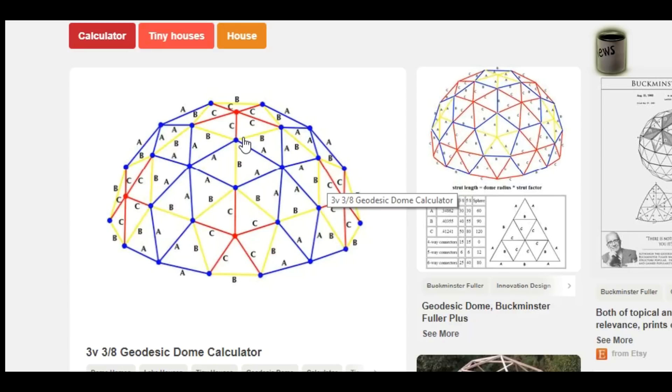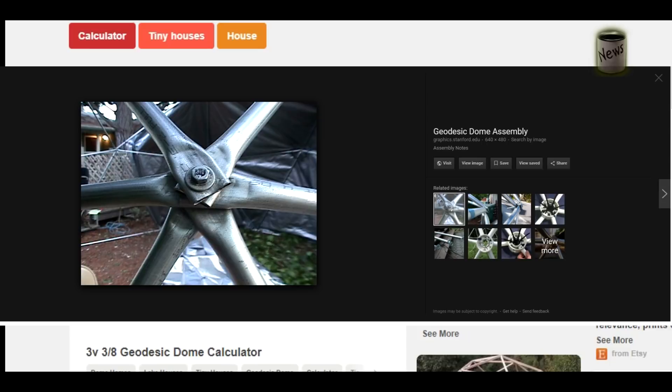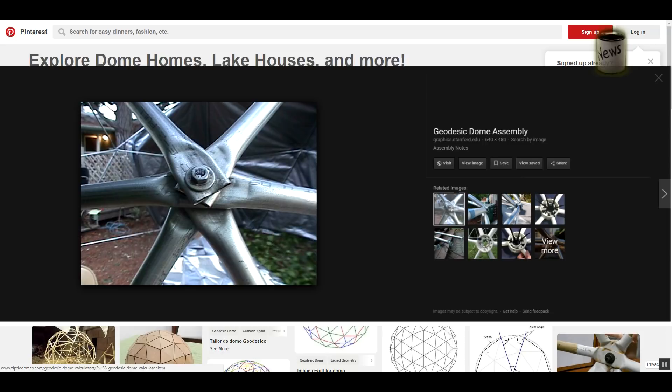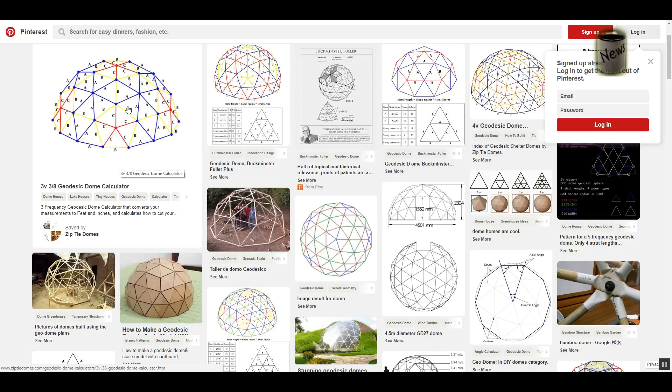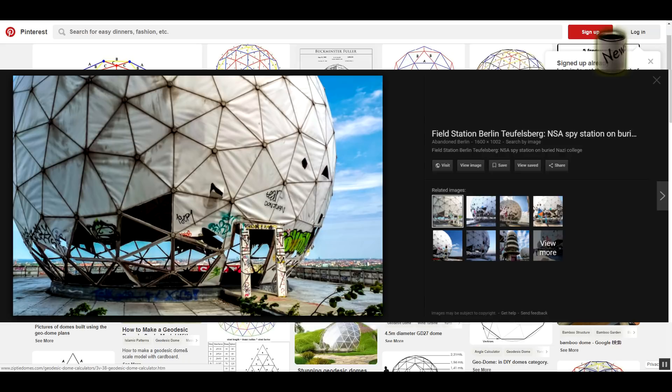Each tube is flattened on both ends with a hole drilled in each. You just line up the holes from each flattened piece, put a bolt through, and tighten it up with a socket wrench. When you tighten it, each end will purse out a little bit — that's what you want — and the structure becomes very strong. Ours you can pick up and move with two people, and it's been out there 15 to 17 years through numerous hurricanes without ever blowing over.